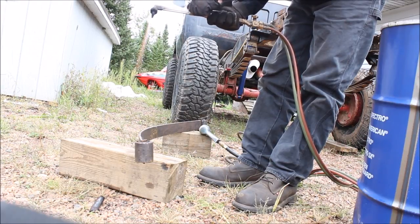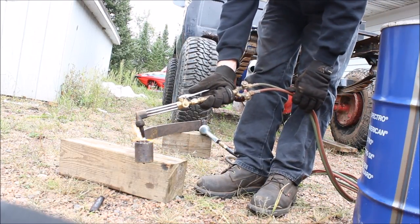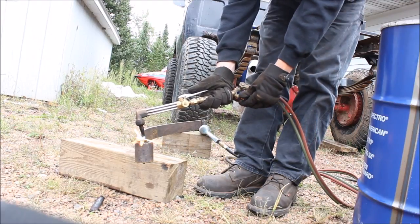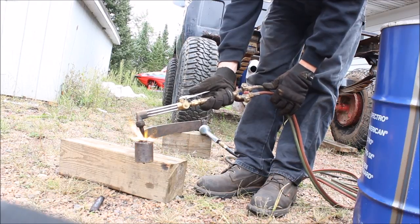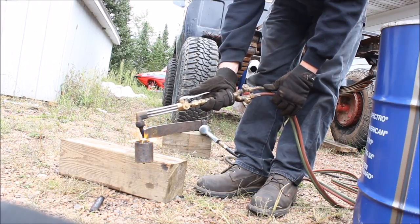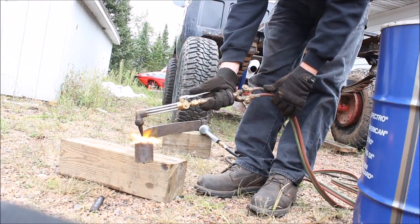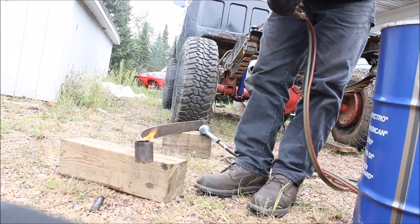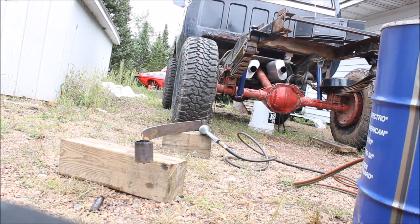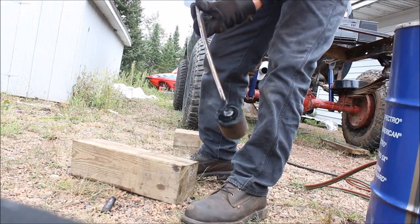Set your oxygen and your acetylene until you get the little blue cones, then just heat this up on the inside. You can give it a little more acetylene and that will heat it up faster. The goal is to get that rubber hot, then you leave it sit for a bit. I usually let it sit until it burns all the way out — you can see there's a flame there. I'll be back when it stops burning. Alright, it's done burning. You can see the rubber is kind of sticky, still smoking a little bit.